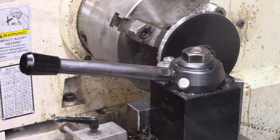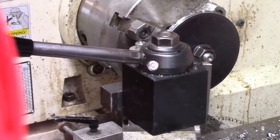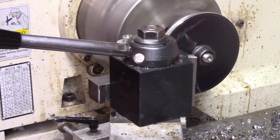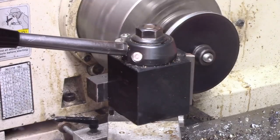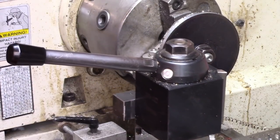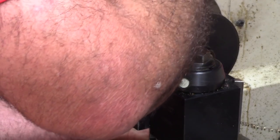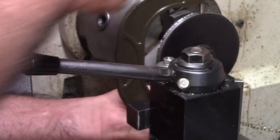Okay, according to my calculations, I've done about 18 thousandths. And Michael is texting me, that's who the ding is. So I'm going to take about 10. Like I say, this isn't the sturdiest setup under the sun. We're going to take about 10. And like I say, I'm wanting to try to hit it within about 3 thousandths. Want this just a little bit loose where it just sort of fits in there. And we're going to tack weld it and everything, so.